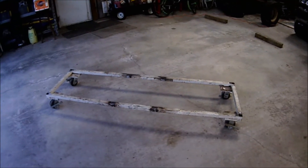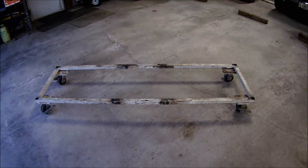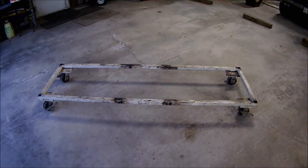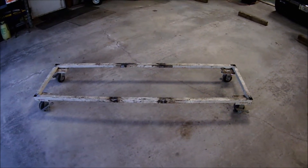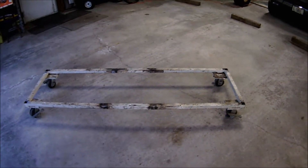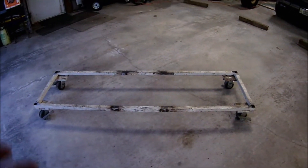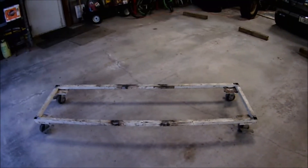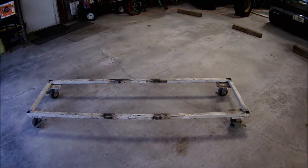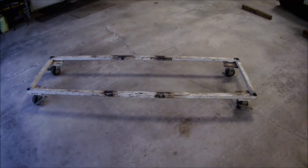Okay YouTubers, I think I'm just going to make this a two-part video. Anyway, there's everything welded up. So now this should be 80 inches long, and it'll accommodate the width of the tiller with the gearbox in the center on that thing - my mistake, Land Pride tiller. Gearbox in the center and it drives off the left side, so that'll be your drive chain and sprockets and all that stuff hanging up that side. And your stands on that side also. We should be about 80 inches long. There's my welds - all four sides of the square tubing ground down.